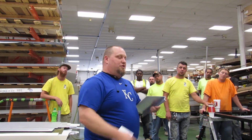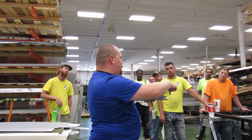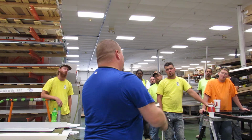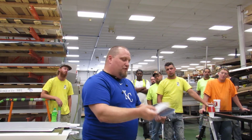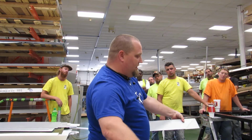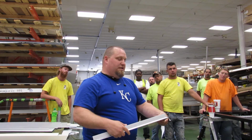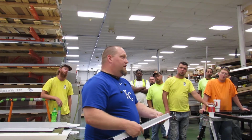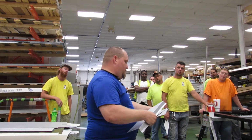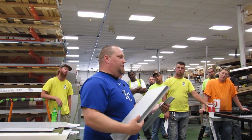You can caulk the splice. Your splice is about water hitting this and not getting down under. If it gets over the edge and you don't have a splice in the front, it's not as big a deal. So if you cut these on a 45 and you just cut another square piece, you can get a splice in your corner and have your caulking in it, and you get a much cleaner seam. Okay? We shouldn't be cutting a straight piece and trying to bend them together. You'll never get a good look.